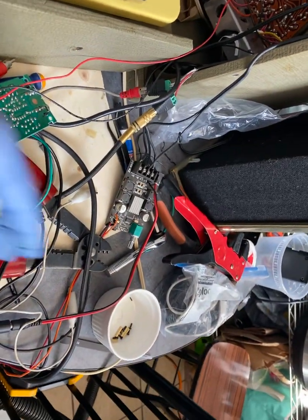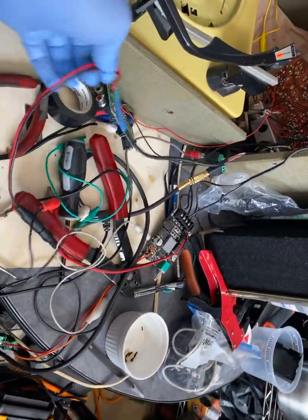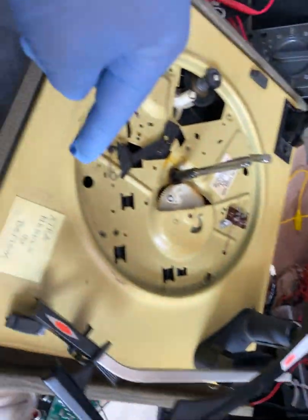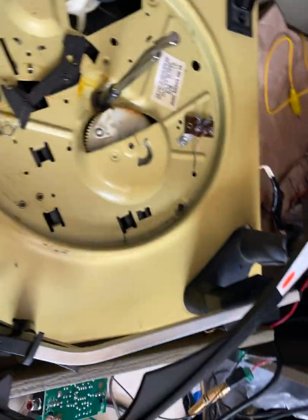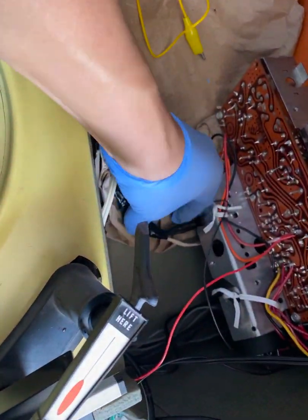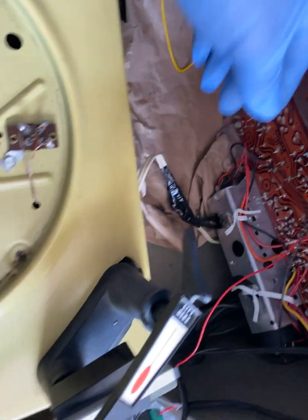They're small. So this is the power coming into it. This connector is running into here. And this power supply is being epoxied underneath here. That is the 18.5 volts at 3 amps power supply in there. And it's getting its power from this white cord, which is the original cord. So I tapped my 2 AC wires into the 2 AC wires of the white cord that belongs to the record player. So now this is how that unit gets power.